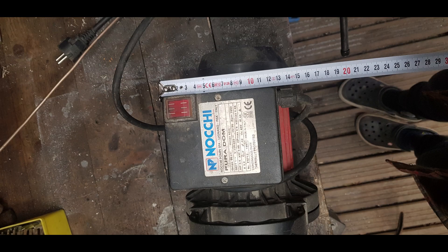Let's talk a bit about the motor, because it played a major part when it came to designing the pulleys. I salvaged this motor from an old water pump. According to the datasheet it's a one-phase 230-volt motor with about 450 watts. Not the strongest one, but if I need more horsepower I can always just swap it out. More problematic for me is that it has 2850 rpm.